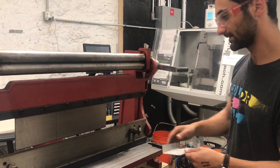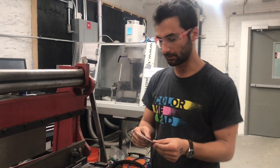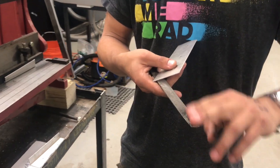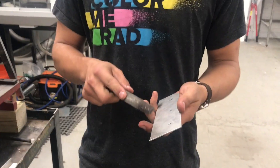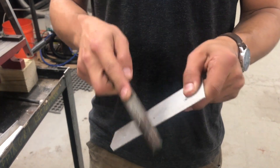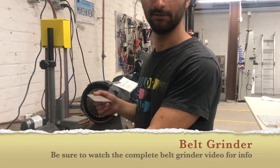So now we have this piece, and there are a few ways to deburr it before you put it in the slip rolls. One is just with a hand file. When you're using a file, it's important to always push — the teeth are oriented so they cut when you're pushing forwards. Sometimes people will drag backwards, and that takes the teeth and flattens them out. So you want to make sure you're using a pushing motion. It's pretty easy to feel the burr — on the back side you can feel it. You can just do this by hand, and that's all it takes to get rid of that little curled-over piece of metal. Another option is using the belt grinder — there's a whole video on the belt grinder, so you'll want to watch that if you haven't already.